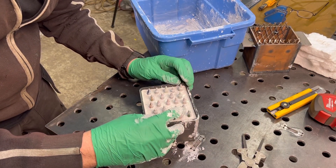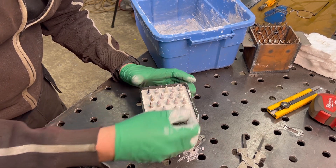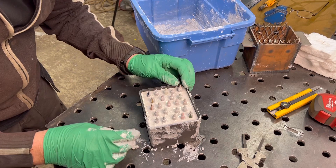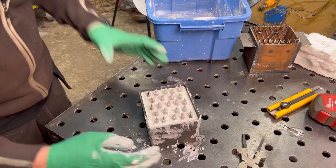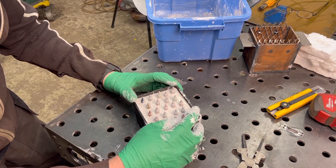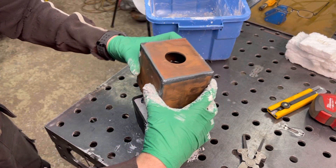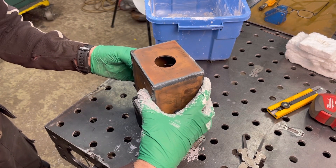I'm going to cry a little because I just made some of my crayons come out — it's not good. Obviously I'm going to have to drill some of them out. I haven't done this mold before, so it's a little trial and error. Now that I have it in there with two crayons broken, I'm going to put the refractory cage of the actual ribbon burner on there, and hopefully I don't break any more crayons.